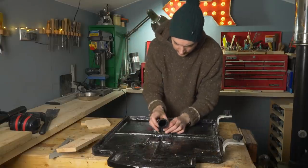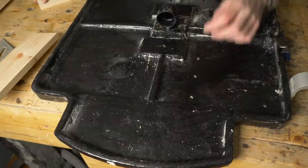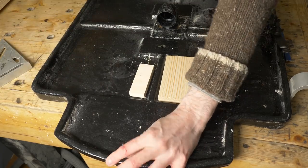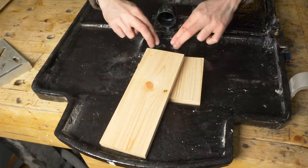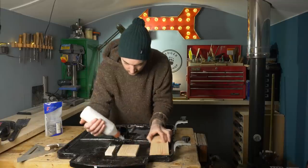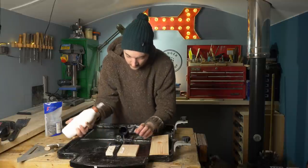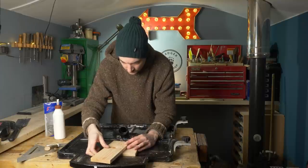What I've got to do this is some black 40mm waste pipe fittings. The table has some holes in it, so I can use them for mounting, but I've got to work around a few of the castings. I've marked on the end where the pipe needs to stick out, so I can line everything up with that, but I've got to miss all the other mounting points. I'll get some PVA wood glue applied to these bits of wood, get them pushed together and then secured in place with a few pin nails.